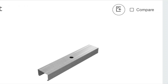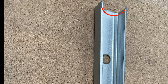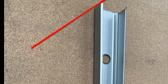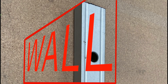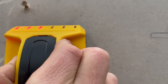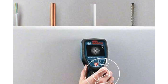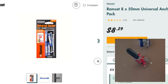Enough small talk — time to visit the big green building to grab some metal studs, or c-channel. I guess it's called c-channel due to the shape. I reckon there's a huge variation in quality for c-channel and this one seemed to be at the bottom end. It's probably welcome news for my drill and a good worst-case scenario for TV mounts. I added these pieces to the test wall. The stud finder had no issue finding the studs, but even a simple magnet would also work. Obviously I still recommend an installer as there might be stuff like PVC pipe or electrical cables.